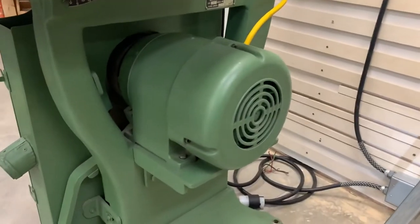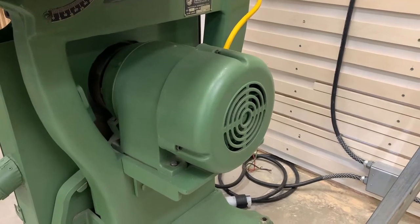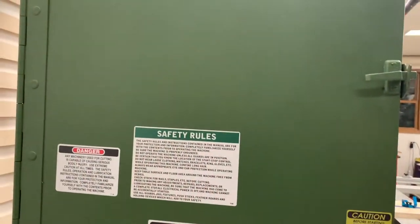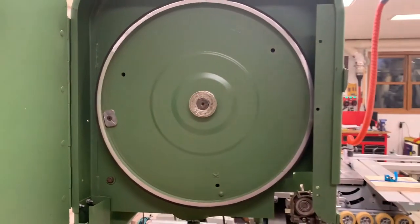There are some things that need to happen. Chief among them is this is a three-phase motor, so that needs to be converted since I don't have three-phase power in my shop. We'll talk about that in a bit. There are some mechanical things that we discovered when we were looking at this as well that we're going to fix along the way. Here is the upper wheel. This is a 20-inch saw, a Northfield Model 20. This is a cast aluminum wheel with urethane tires. This was actually just redone by the factory, so the tires are brand new - I doubt they have an hour of run time on them, which is great. There's actually nothing to do on the top wheel; we're in great shape there.